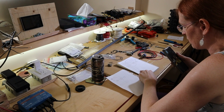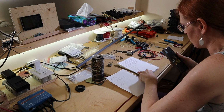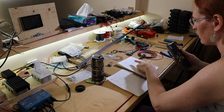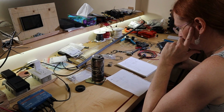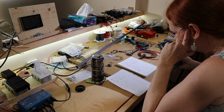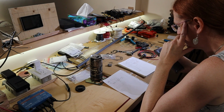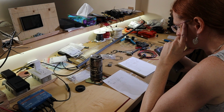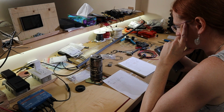So this negative lead would have gone to a much higher voltage potential. And now it's reverse polarity with respect to your capacitor there. And that's what blew that up. The capacitor can't take any reverse voltage at all. The only reason the voltage spikes up is because there's no current flowing, and it wants some current to flow. So the voltage will keep spiking until some current flows.